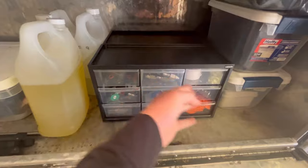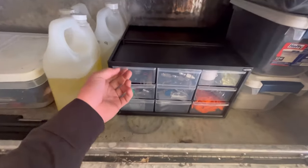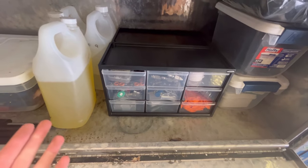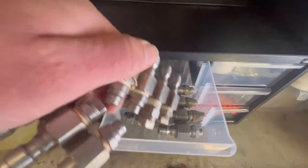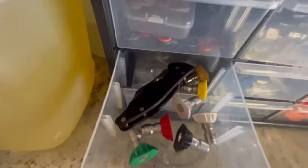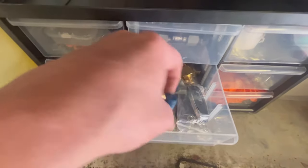These little tool organizers are where I keep all my little odds-and-ends parts so they're not all over the toolbox. First things first, I have my three-eighths and quarter-inch O-rings because O-rings inside your quick connects get chewed up all the time and next thing you know you're leaking chemical all over your arm. I have some spare J-rods, nozzle holders — I like keeping four or five on the truck. I have some thread tape for whenever I swap out those quick connects, a little tub for different nozzles, and downstream injectors. You can't have enough of these — I like to keep a few on the rig.